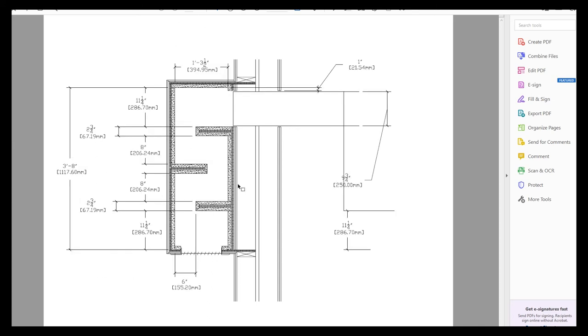And even in that thing on the internet, there were some very specific dimensions, some dimensional analysis. Again, it's not going to be the same for everybody. But I think one of the key things, and you'll see it in Rod's book and also in normal HVAC design, is that velocity in the duct will heavily influence noise in terms of just the breakout noise. So that's noise associated with airflow. And also having these right angles in the airflow actually helps isolate the noise of, say, the fan from getting into this space here, because it just makes it harder, along with these acoustic surfaces in terms of attenuation.